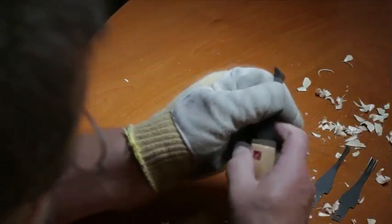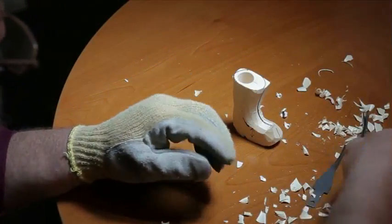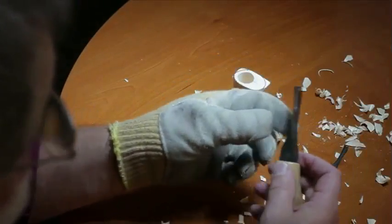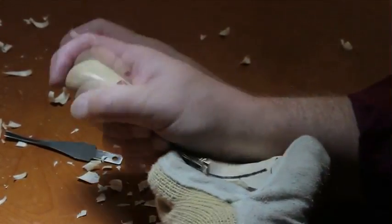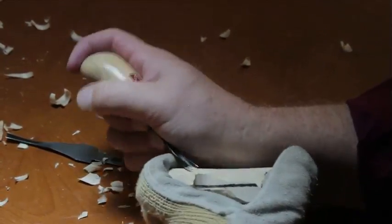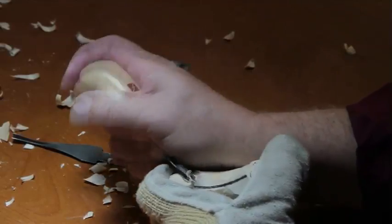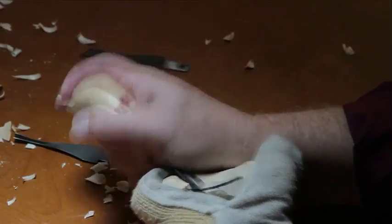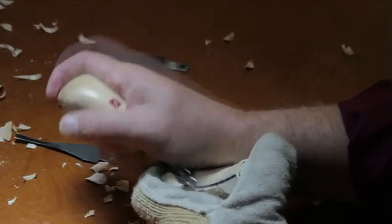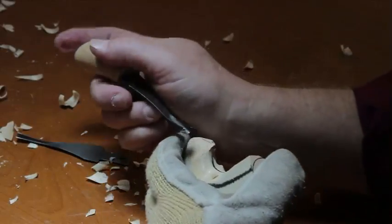Also like to demonstrate here, taking out the tool, still rounding the toe, and using the gouge also. So you simply slide that in, and then using it, you're simply using your wrist to come up and take off that wood area. And you see that using this number 11 1/4-inch gouge, you can take off quite a bit of wood and round that up, stepping up just each time as you go back across there. And you would do the same on the other side.